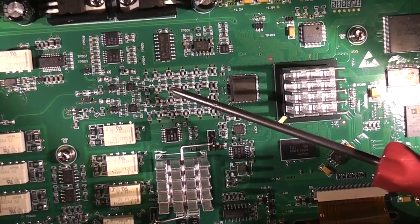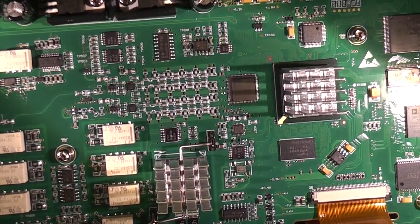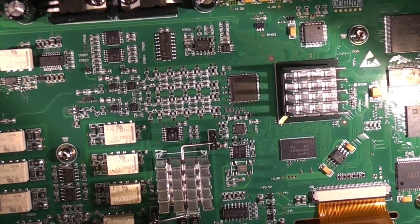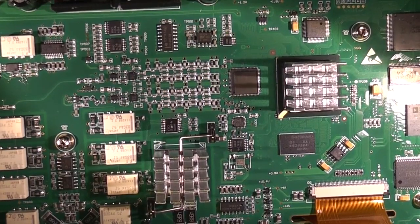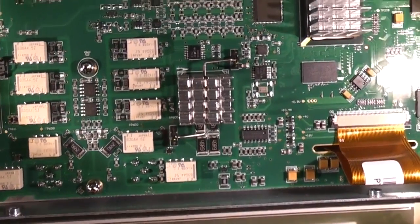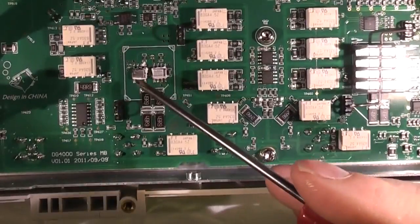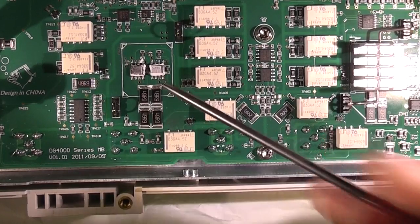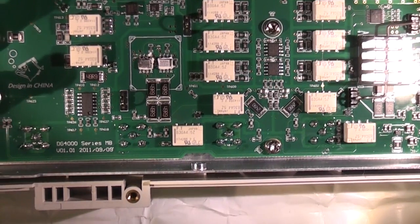All this stuff on here is filtering for the output of the DAC — to turn a sequence of digital samples into an analog waveform. This is the first level of analog filter, and there are about 4 or 5 stages of inductor and capacitor filtering on there — a fairly complex filter. There are also a few op-amps and analog multiplexers surrounding it. Down here is the output stage — basically an output amplifier. There are relay-switched attenuators here. I've pulled the heatsink off one of the channels and they've lasered off the chips again, but these are just going to be 50-ohm buffer chips.